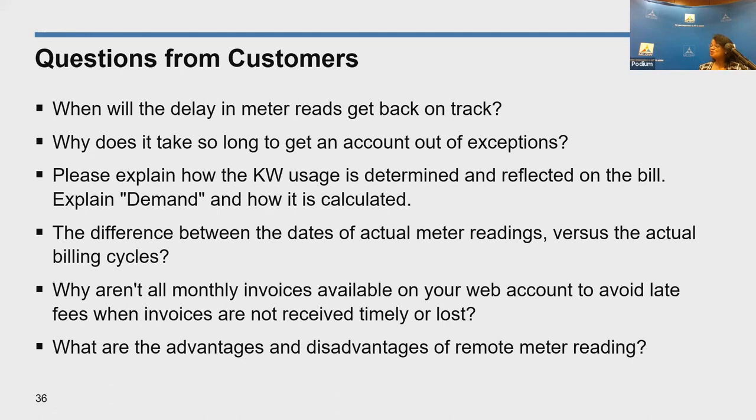And so that is actually very valuable, right? We see 24-hour usage today and we put a letter in the mail for you that night that says, hey, you really should check into this. Other than someone filling a pool or having a special process going on that they knew about, I've yet to see someone who didn't have a leak when they got that 24-hour letter. They'll tell me they don't, but eventually they usually come back and say, you know what, you're right, we found it, because we saw water usage every single hour at your site.